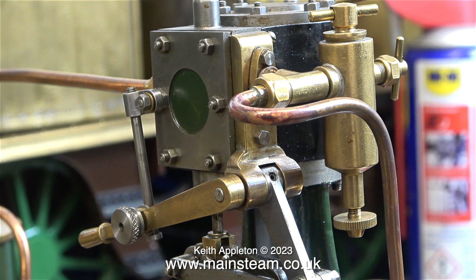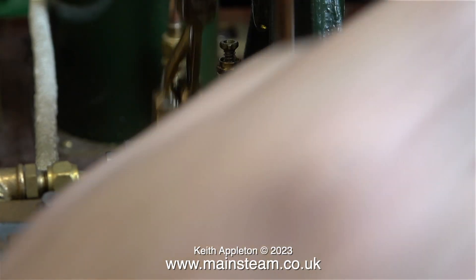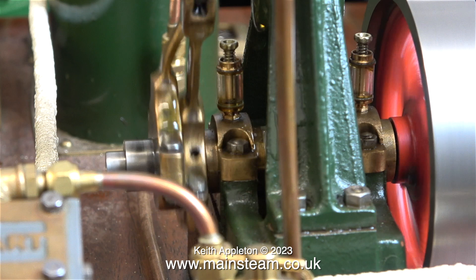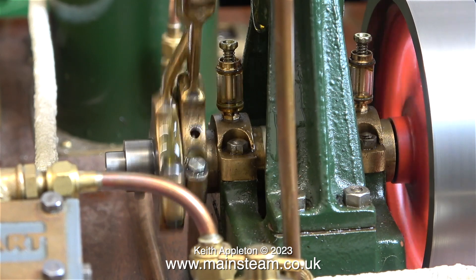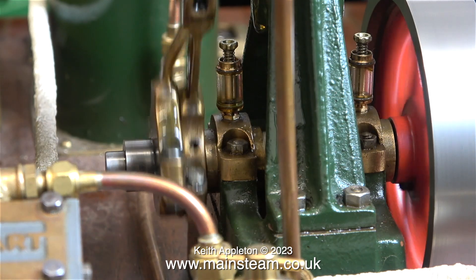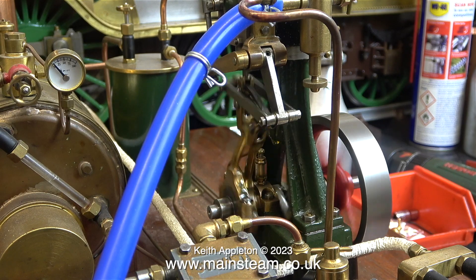But it is quite a modification from the drawing. Very much like the 7A that I showed you earlier — he's sort of copied it. The difference being my grub screw in the drop arm goes into a detent drilled in the shaft, so it can't move. Also, this engine uses the eccentrics machined as a pair, so the timing isn't perfect. It runs really well in one direction, but it knocks slightly in the other direction. It does, however, overall, run very well indeed.